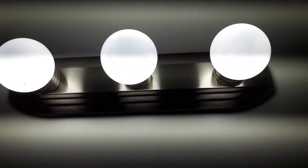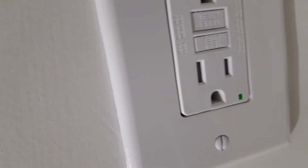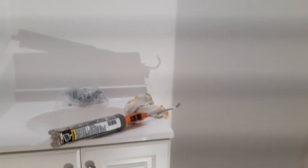So the lights — on, off. And the GFCI, as you can see, is on. I have a green light on the GFCI receptacle here. Let's try to trip the GFCI right here and see what's gonna happen. No more light in the bathroom. So we have to reset — and as soon as we reset, we have light, we have the fan. So this is the finished product in the bathroom here. As you can see: the switch, the receptacle, the fan and the lights. The light on the wall, the fan on the ceiling. And out here we have a receptacle for you.